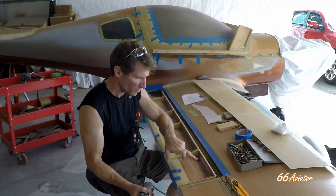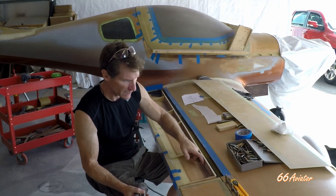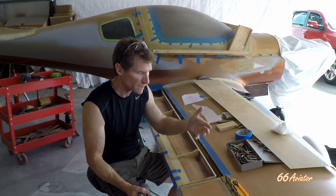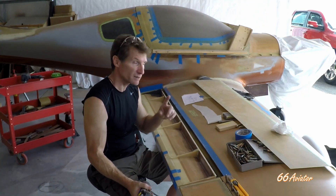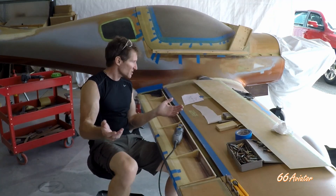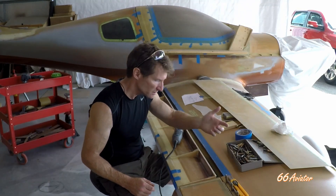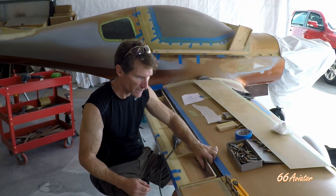The next step on both sides: the back side has to be reinforced with two layers of fiberglass from the bottom to the back, and then the front side gets three bid on the entire front all the way down. It also gets seven additional bid at each hinge location, for a total of 10 bid — or 10 layers — at each hinge location on the outside and another two on the inside, so 12 layers plus what the rib already has.